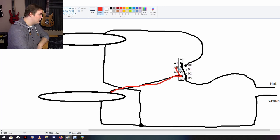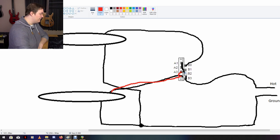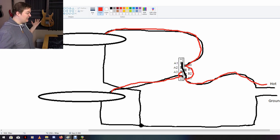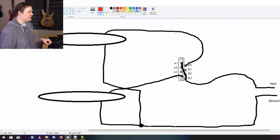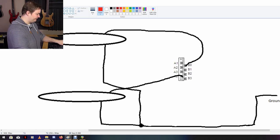Position two — the bridge goes here and out, and the neck pickup also goes to B0, B2, and out — both are active, exactly what we wanted. Position three — the bridge pickup goes to A3, which is not connected in any way, so it's muted. The neck pickup goes in to B3 and out. So now only the neck pickup is active. Both wiring approaches work perfectly fine — it's just connecting things the other way around. There are multiple ways to achieve your goals.